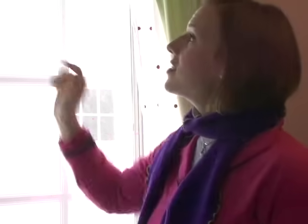When you're getting ready to weatherize your window, make sure you put your weather stripping on first before you put on the plastic, so you can still access it. Also make sure any extraneous pieces from old blinds or the movable parts you use during the summer to open and close your window come off, so they don't interrupt the plastic.